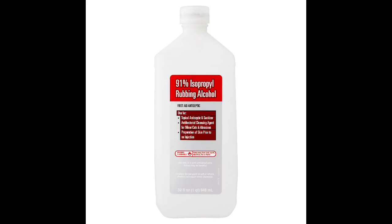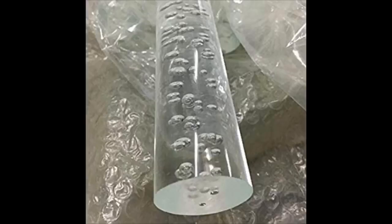For plastics, it definitely generated a little more heat than I would have liked. When you generate that kind of heat, you open up some micro-cracks in the acrylic. Then when I was cleaning and prepping it with alcohol, I might have done some damage — that's the crazing part. Although I didn't mind the way it looked, I'm worried about long-term survivability and how it's going to hold up. If you drop it, I don't want it to be fragile.